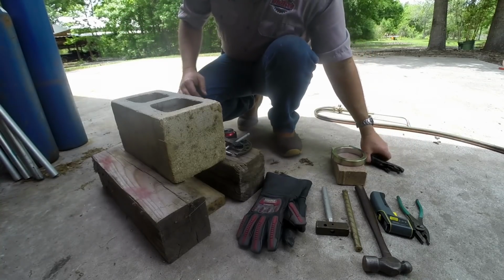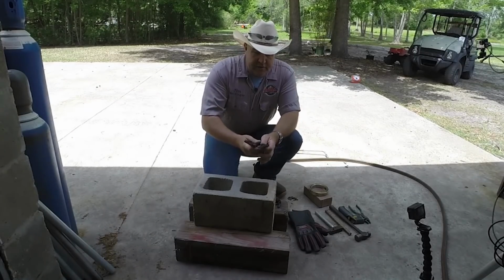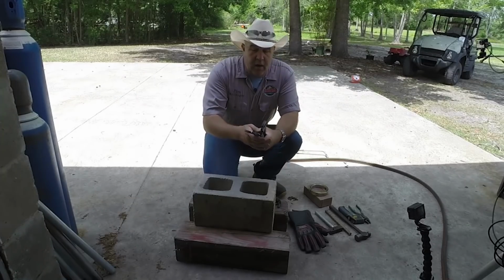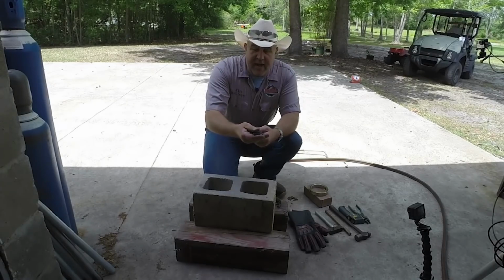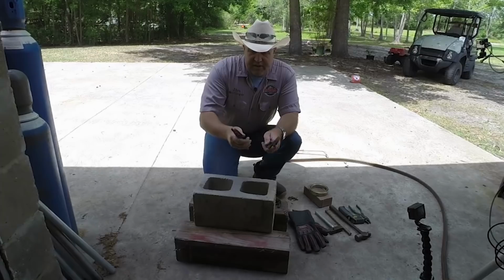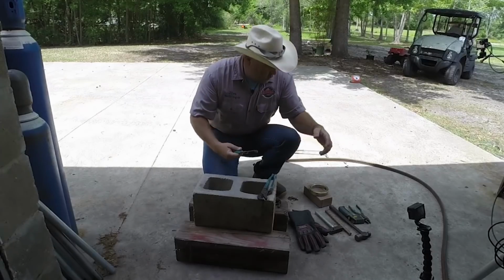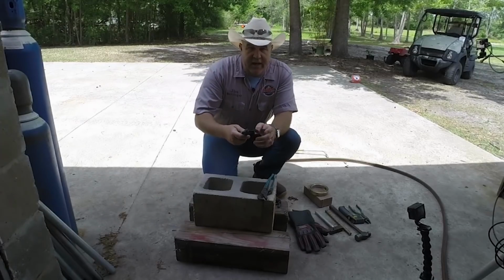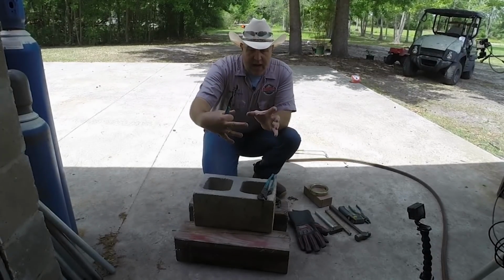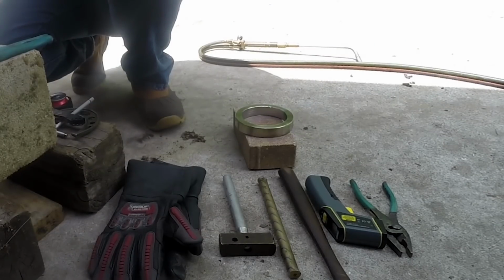And then I have a couple pairs of channel lock pliers. The idea here is this: you're going to see me, when I fire the torch up, put some heat on the ends of these. I'm not going to get them roasting hot. What I'm after is to put a couple hundred degrees in them, maybe 250, 300 degrees. I want that just in the tips, not all back here in the handles. Outside air temperature is probably around 92 degrees today, so these are about 92 degrees. Well, this thing is, let's just say, 400 degrees, and we grab it in 2 spots with these. These act like a chill or a heat sink, and they start pulling the heat away and shrinking it in 2 spots and making it change shape. It won't be round anymore. It'll start to oblong because 2 sides are starting to contract, and that can cause us a problem.